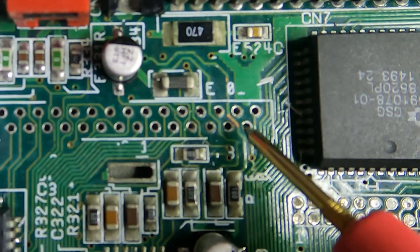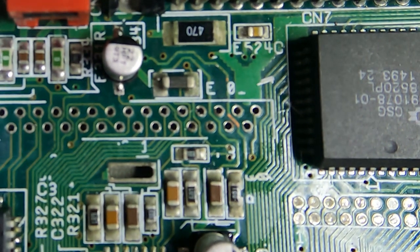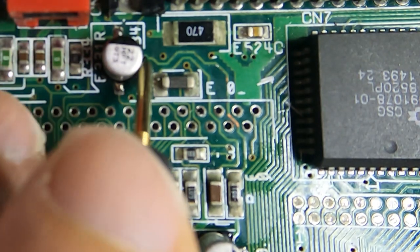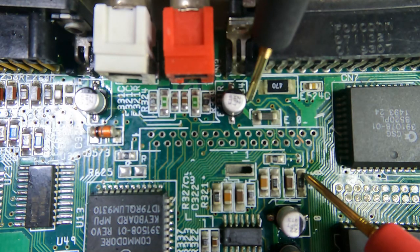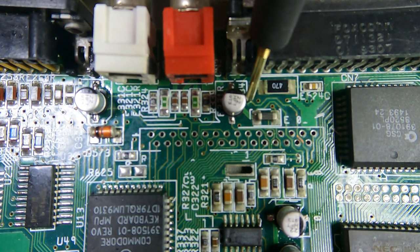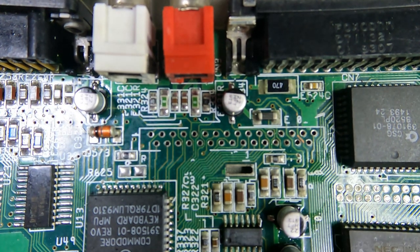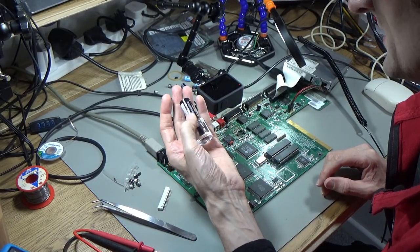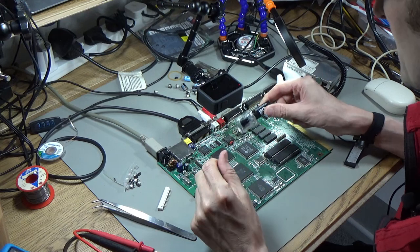You can see it's just there that's gone off that trace. Let me just check that trace is actually still good. Yeah, it's connected — so the trace is still good, it's just got no solder mask on top of it. I've just got some nail varnish that I can put on that — a bottle of Rimmel London clear nail lacquer — so I'm going to try and use that on here.